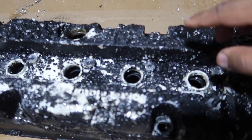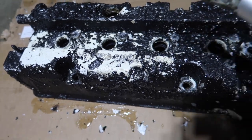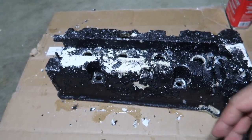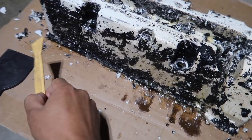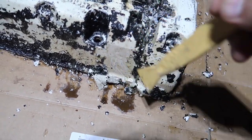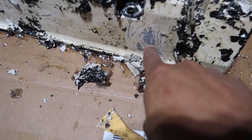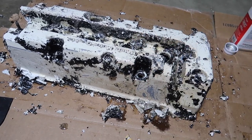You can already see it wrinkling and bubbling off. Look at this — it just peels right off. Going to get to scraping once it's done. Hopefully everything comes off nice and smooth. I've got a few different scrapers — a big one, a smaller one, and a tiny one. Left it for a while and it's peeling off rather nicely. Trying to get both layers off so we're down to the base coat, then we can degrease it and start with the paint. Wrinkle red coming soon!